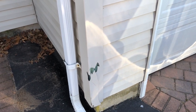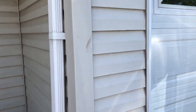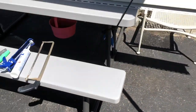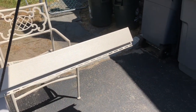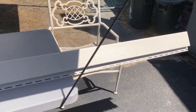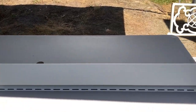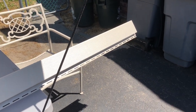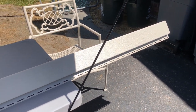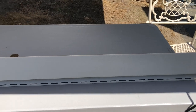What I did was I went out and bought another piece of vinyl siding outside corner. After measuring, the measurement on the broken piece is 78 inches. They sell them in 10-foot sections, and here's a 10-foot section. So I will mark this to 78 inches and cut it appropriately.